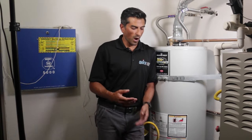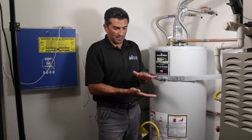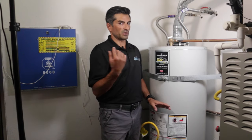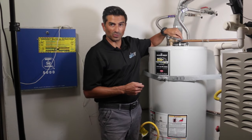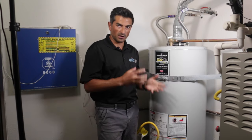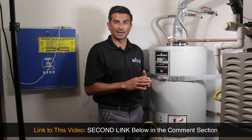The final section is section three: why won't this thing actually drain? What happens is when you heat water up, it separates the calcium and magnesium from the water and deposits all the minerals at the bottom of the tank. As they settle, they compress like dirt and eventually clog up the valve. This is also happening throughout your whole house - all the pipes are collecting sediment inside them. As sediment collects, it can create pinhole leaks, build up on your shower doors, etch into your fixtures, and cause you to replace faucets constantly. The best way to get them out is a water softener or a no-salt softener - find more information at quickwaterheater.com.